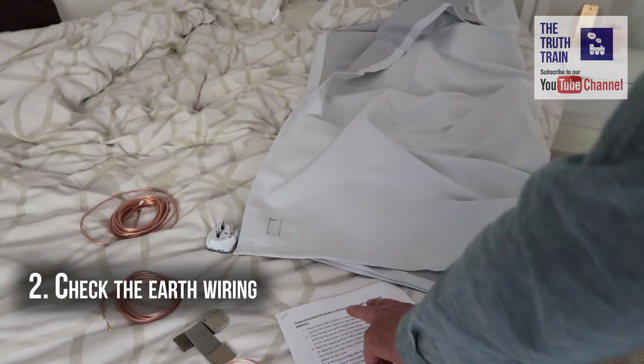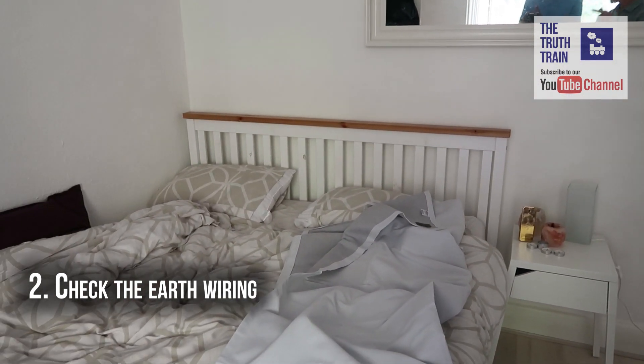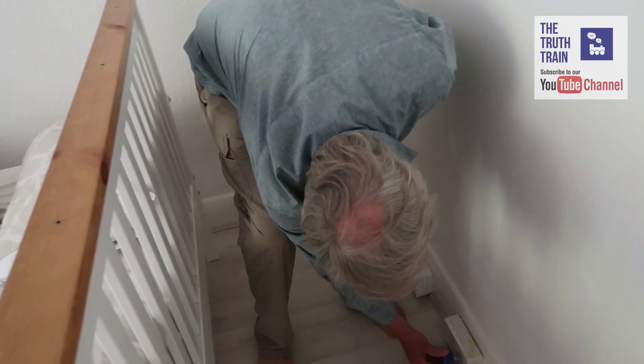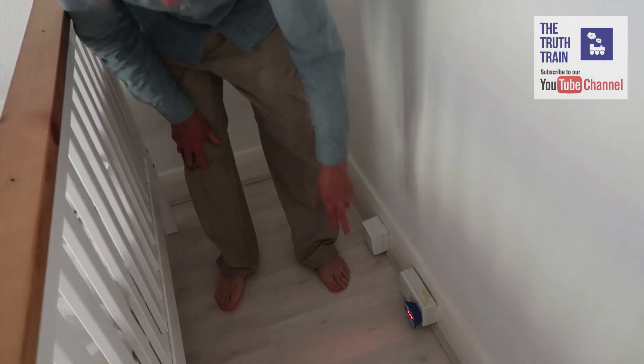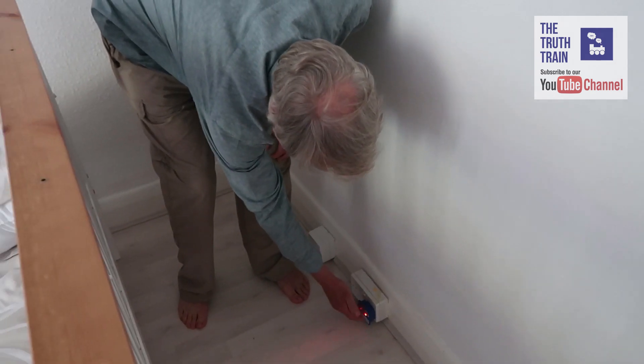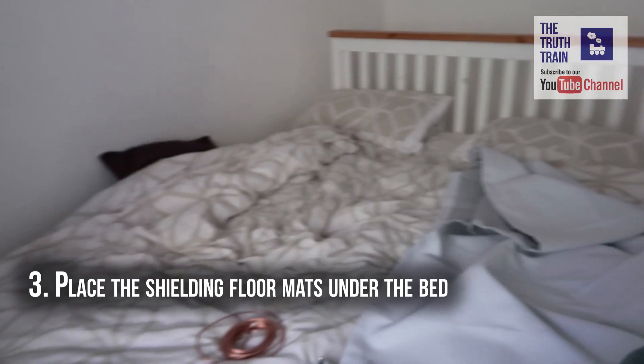Check the central light position — in this case it's out of the way. Check the earth wiring: look for where the nearest socket is. There's one just there — brilliant. Plug the socket checker in and turn it on. You should see three lights light up. If you don't get all three lights lit, don't plug in and get an electrician to check the plug.